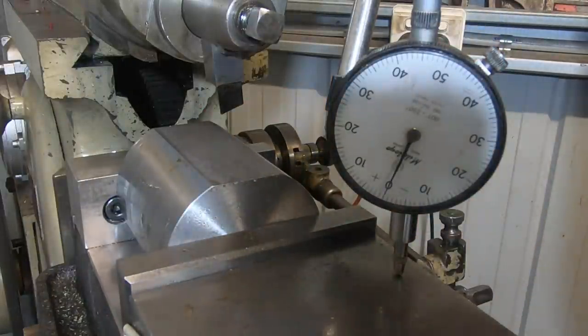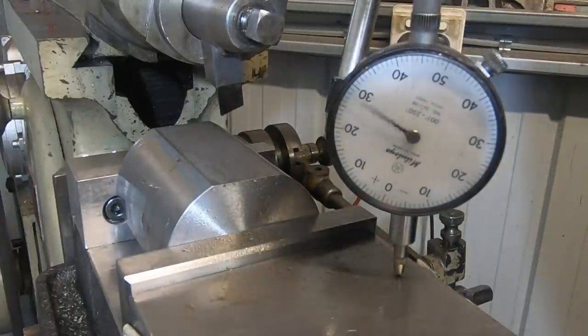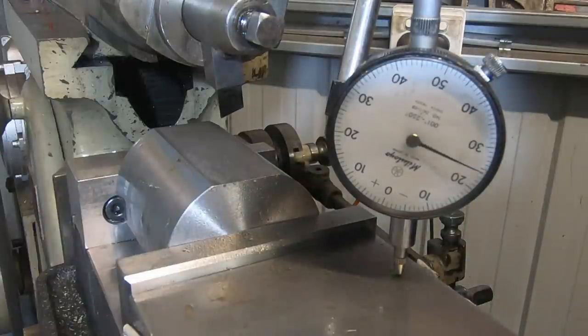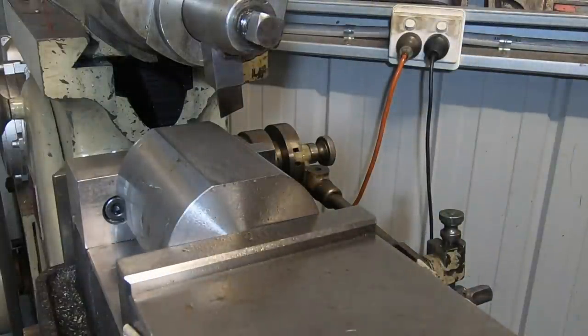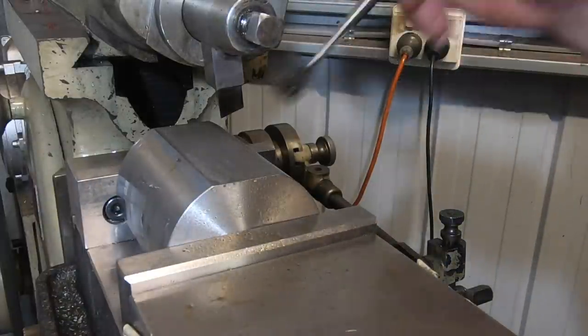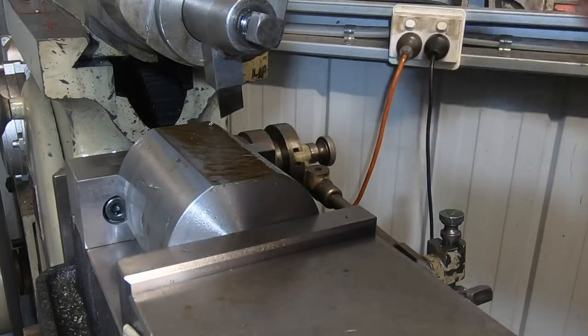So we're going to have a go. I've been doing 50 thou depths of cut. I'm going to try 75. 50, 60, 70, 75. We're going to see how it goes anyway. Nothing to lose, everything to gain. We'll see what happens. It's only got a 5 thou step over. If this seems like it's too much, I'll knock it back to 50 again.